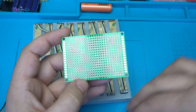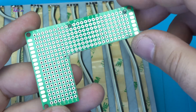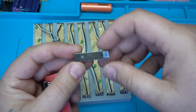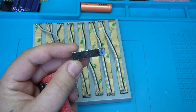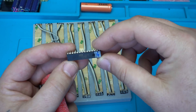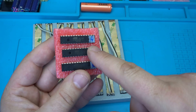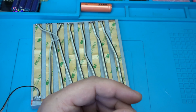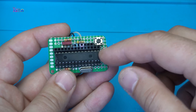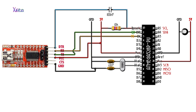Let's continue with the project. I've already cut a small piece for making the Arduino board, and I'm using ATmega328 chips that will be programmed with the code for driving the NeoPixel LEDs. By the way, the code is available in the description below. Note that the ATmega328 chip needs a 16 MHz oscillator to operate. I'm going to put a circuit diagram on screen so you can see it — this is the basic DIY Arduino board.